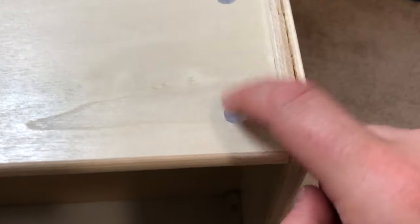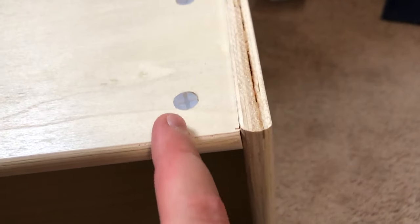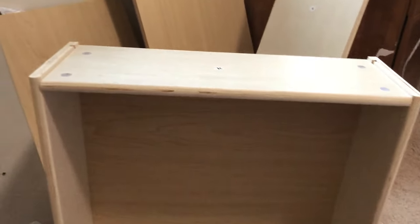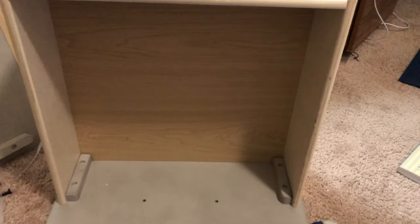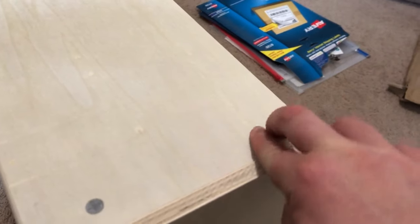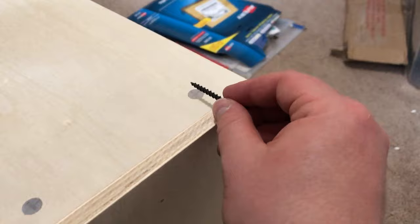When you install these — they're like the little cam lock things we used earlier, but the ones we used earlier were metal. These ones are not; they're kind of like them but they're not. They fill the gap and it looks like you have to twist them to lock the screw in place, but you don't — they act as little plastic washers for the screws. Now this dresser top number one is done. I'm going to build the second one; the others go the exact same way. When you put in these little EE washers, there's a little hole that needs to face where you're going to be putting the screw in, so the screw can go in through this hole and through that hole to tighten it down.